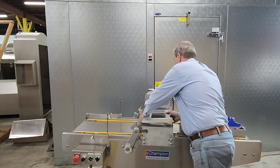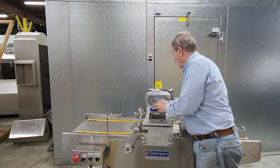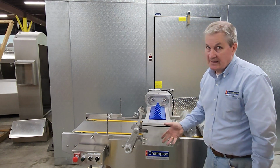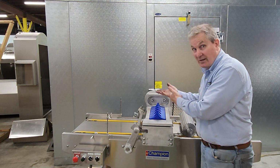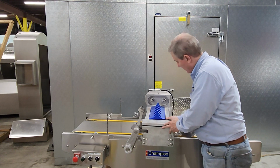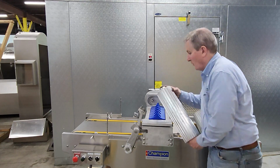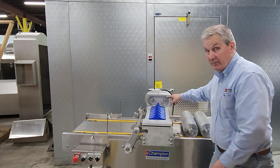We take the die holder as the first part to go in. We take a die and it falls in. You can put it in one way or the other without mistake. So it's easy to put in and not guess how, where, or how approximate. It's all done for you. Once that's done, I like to make sure there's a little room back here for the hopper to fit in. One other thing to show you is the bayonet pin setup. The extruding rollers will fit into these bayonet pins and be driven by them.